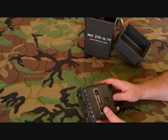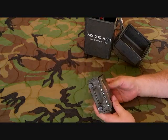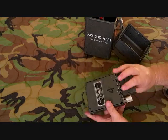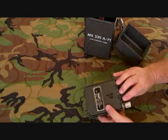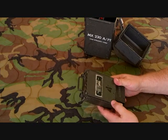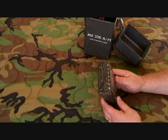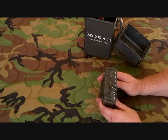And this is it right here. It's an aluminum case. It actually clips on the side of an SB22 — we'll do that later. It holds a 9-volt battery, a piece of field wire connector right here. It actually plugs into the terminals on the back of the SB22 labeled the emergency operator. Basically all this does is produce the touch-tone tones. That's all it does.